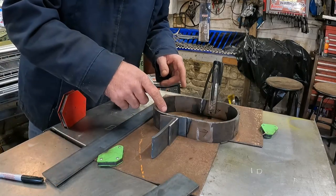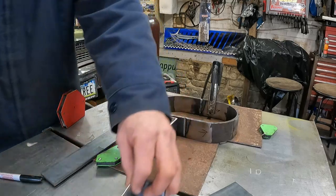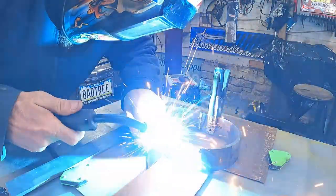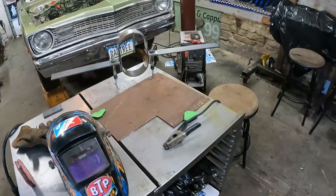Okay, so what I'm gonna do is tack the angles on, cut these two, tack them, and then just go under the car and see if it goes in or out or what have you. Quick and dirty. Take into account too where you weld this, that if that's your line where you want it to land, you gotta go up so that coincides with your strap going all the way across. Right? Good. Don't know if you get the drift yet. Something like this. See?